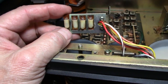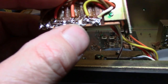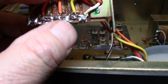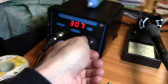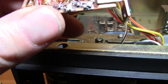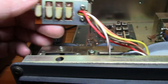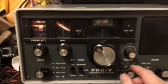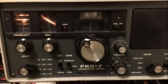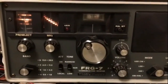I opted to put the light condoms back on, and I'm kind of glad I did because I have a cold solder joint right here on this light — I need to touch that up. I just turned my soldering iron back on; I'll let it heat up a bit more, fix that solder joint, put these back in, and then we'll go from there. WWV on five megahertz.